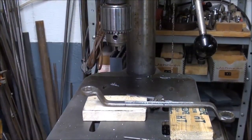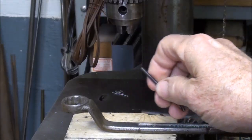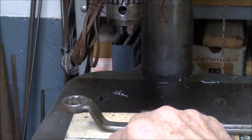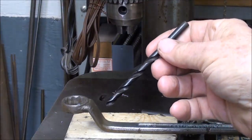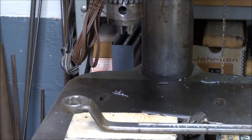Gremlins got into my camera and removed video clips — that was the clip of me drilling the 1/8 inch pilot hole in the wrench using a solid carbide drill bit, and it drilled like it was butter. Then I went in with the second bit, which was a quarter inch high speed steel bit, and that wouldn't even begin to resize the hole. So now I'm going over to the Bridgeport Mill and using a solid carbide end mill to enlarge the hole to one fourth inch.